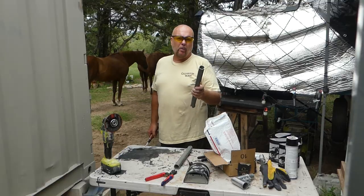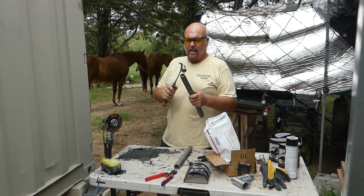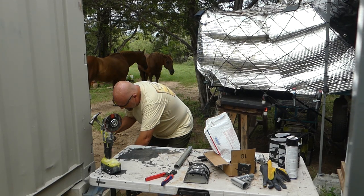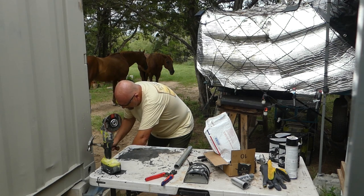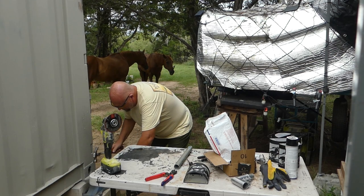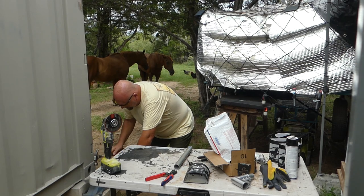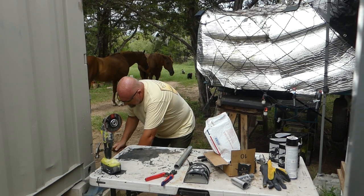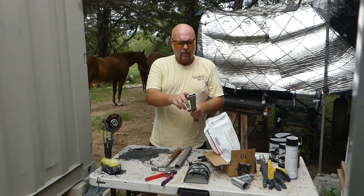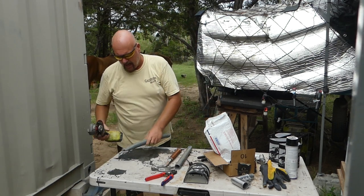I'm going to go ahead, that worked out. I'm going to peen it over a little bit so I can see where the bulge is, and then I'll cut the notch from there. Now, if I do it that way, I won't bite down in the material here and weaken it. The back will be strong, so let me cut the notch in it now.